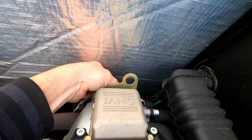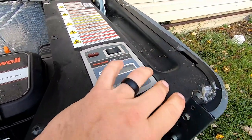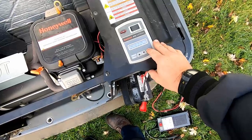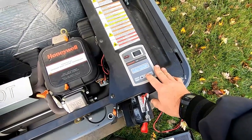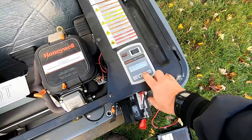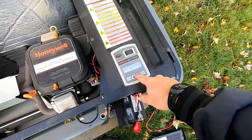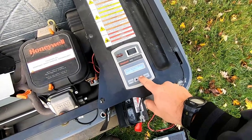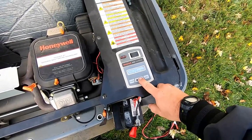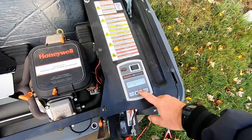Everything's tight, all our spark plugs are on there, so we can clear this thing out by going to Off and hitting Enter, switching to Off. The date looks to be correct; the time is off just a touch, which is easy to adjust. Going to Edit, Reset Maintenance — there's your exercise time, set for Tuesdays at 10:40. Adjusting the hour and minutes — we're about ready to go into daylight saving time. On some of these older controllers they didn't have daylight saving time built in, so they'll be off by an hour.